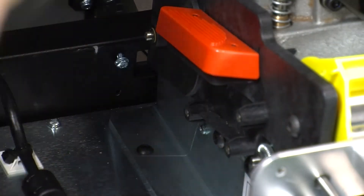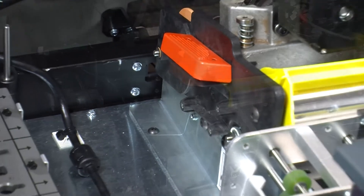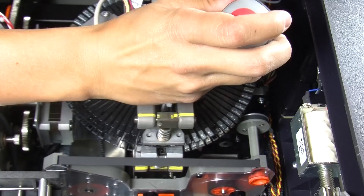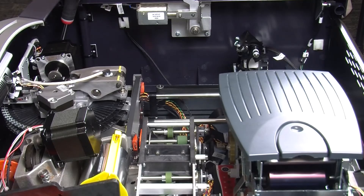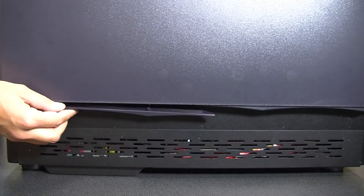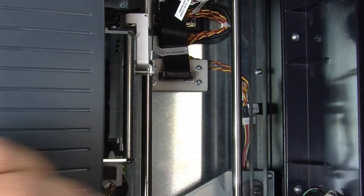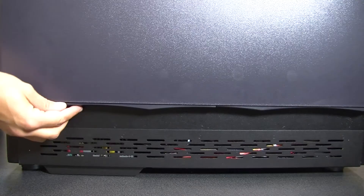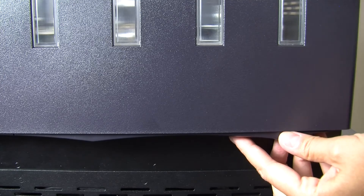Reinsert the two screws just below the LCD, adjacent to the foil tipper assembly. The front cover is secured with four screws on either side's interior wall. Insert the two adjacent screws near the front of the Express Card on the embosser side, and line up one of the exterior panel covers so that the diagonal is facing toward the middle. Secure the screws one at a time until the panel cover is flush with the base of the machine. Next, line up the other exterior panel so that its diagonal is facing toward the middle, opposite its counterpart. Reinsert the two screws near the printer so that the second panel cover is flush with the base of the EC2000. Repeat this on the hopper side so that all four screws and the two exterior panel covers are in place and the front cover is secured against the base.